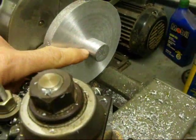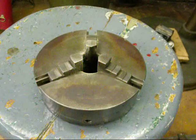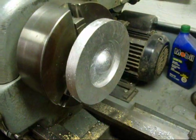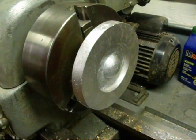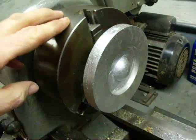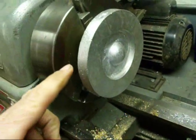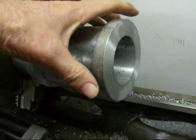Now I'm ready to put the work in the three-jaw chuck holding it by this stem, so I'm going to switch chucks. I have two three-jaw chucks because there's nothing more miserable than reversing the jaws on a three-jaw. I may be showing you more steps than you want to know, but if you want to make it easy on yourself you need to go through all of these steps. I put the other three-jaw chuck on — that only took 45 seconds as compared to whatever it takes to reverse the jaws. Now I'm going to turn the outside diameter of this to equal the outside diameter of the cylinder.